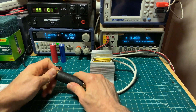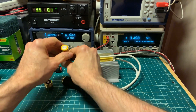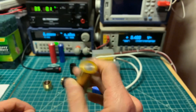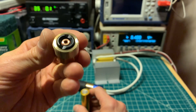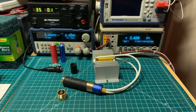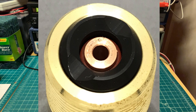Okay, let's take a peek. We can see there are some black dots and arcing marks. I can see it now — there's an arc mark. Checking with a loupe — yeah, there's a bunch of arcing. It's not severe; there are a lot of them but not deep arc marks. Which is expected with flat contacts — moderate arcing damage on the copper contact.